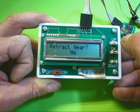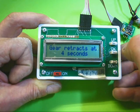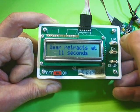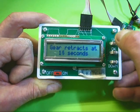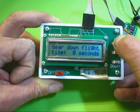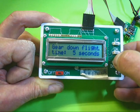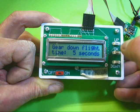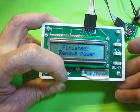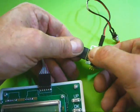On my latest model I'm running retracts, so retracts up is set to 4 seconds. Usually the retracts-up time you want is 15 seconds from when the motors start up, so I go to 15 seconds. Then it says retracts down — that's the time after the retracts come down that the model stops. Press OK, then Finish, and that's how easy it is to program the whole unit. Then unplug the main plug from the timer and plug your speed controller back into it.